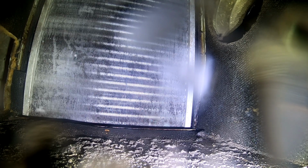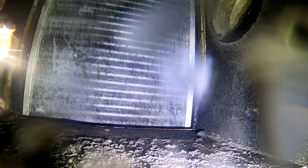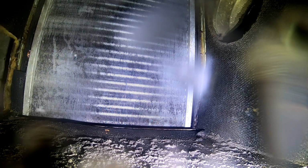Right now, I'm spraying the coil a little bit, backing up a little water, because the primary is not draining. It's draining straight into the emergency pan. And every now and then I'll bring the water hose through the house, because they're redoing the floors here. It's a vacant house, so that's why I decided to go ahead and clean that coil as much as I can.